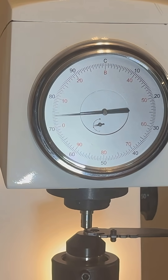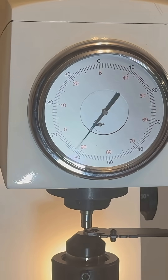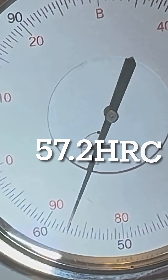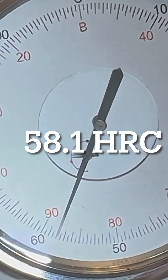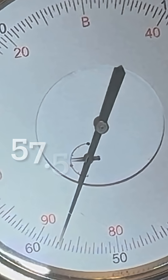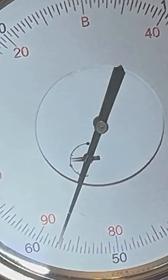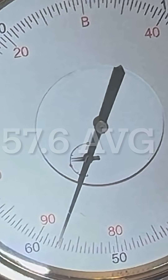Starting with the coated blade, from which I removed the coating before testing for hardness — just enough coating was removed to test the blade. Zero set. Poke number one — accelerated 2x because it takes 10 seconds to apply all the load — and the results come in at 57.2 HRC. That's not good. 58.1 on the second poke — that's bare minimum for D2 steel. Third poke: 57.5, for a pitiful average of 57.6.